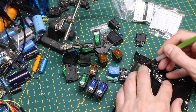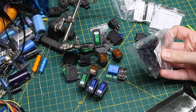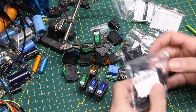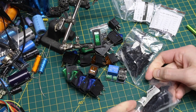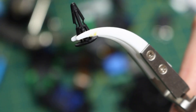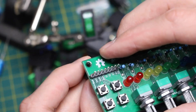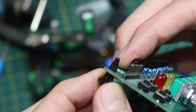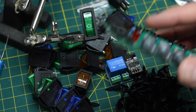This I'm not sure what it is — I could not see any tracking and there's no description. I now think those are plastic standoffs for PCBs. It's one of those packages that had five or six labels on top of each other and barely had a shipping address anymore. I don't remember when I ordered these, but if I want to keep a board up off the surface and don't want to put any screws, those just push in and stay retained. You can squeeze them to remove, and the board will sit up off the surface so nothing will short out on the bottom.